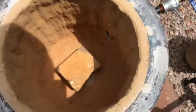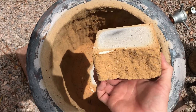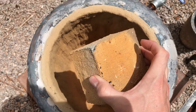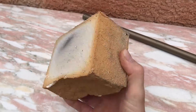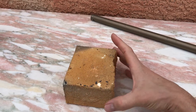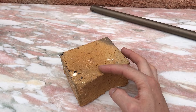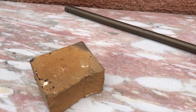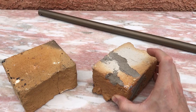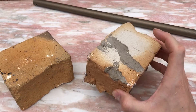Here's a plinth that I've fired several times. It just has a very thin coating on it, and the ceramic brick itself was already cracked before coating. As you can see, it has definitely survived. If it were uncoated, the burner flame would basically melt the brick and cause it to crack. Here's another plinth with only one firing — brought up to 2100 to 2200 degrees Fahrenheit — and I've already started to patch it.